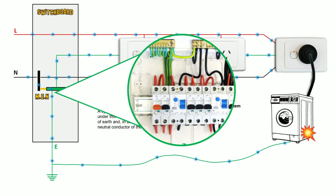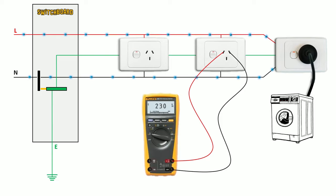That is the vast majority of installations across Australia and the world. Now, remember potential difference — the difference between the active and neutral conductors. But what's the potential difference between neutral and earth? Well, as you might have guessed, it's zero. They're connected together through the MEN link. There is some floating voltage so it's not exactly zero. That is how I knew it was safe to connect neutral and earth to the guitar. Plus, I've been doing this for 15 years.